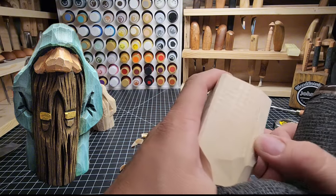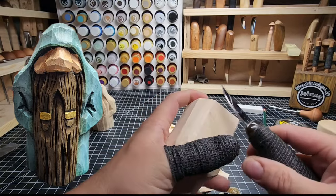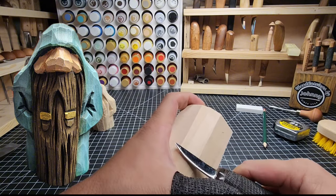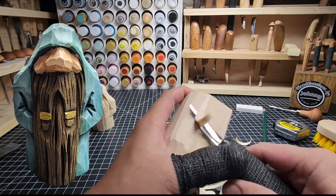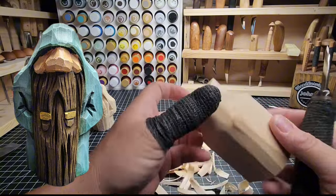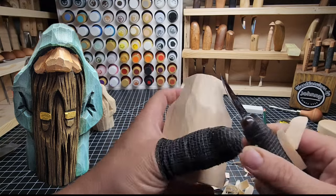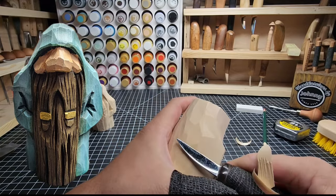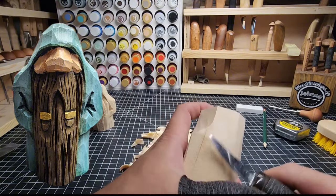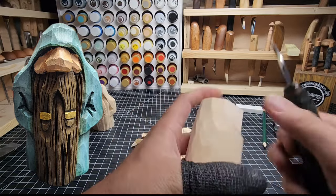You can correct it and smooth it out - you can see how it's tearing there in the wood. You can correct it by taking thinner slices. When I'm taking a lot of wood off, I don't mind this tearing. But if I misjudge it, I'm going to be taking too much. If it starts biting too deep too quick, change directions. I should stay this direction because this is the direction the wood grain wants me to go - slice through the wood and not into that grain, which would bite down and go deeper as you progress.